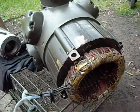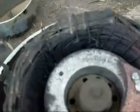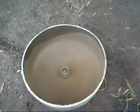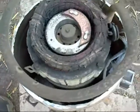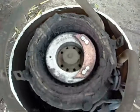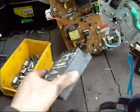Time to get into the next one. This is the second compressor, and I guess it didn't like having to compensate for the one with the bad conrods — it's incinerated its windings. It is cooked. The housing is full of soot and residue. Whatever refrigerant they recovered from it obviously wasn't worth using — very bad burn out. I'll pull this one out and check the crankcase; maybe it suffered the same damage as the one before, except this one may have jammed up and subsequently burnt the windings. I'm guessing these overload protectors are good for surge control and single phasing, but obviously it didn't save it this time.